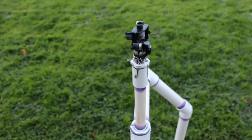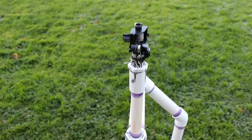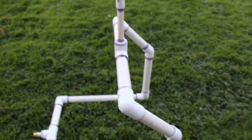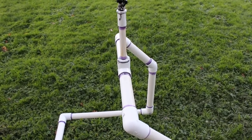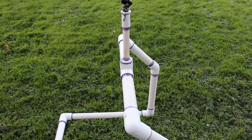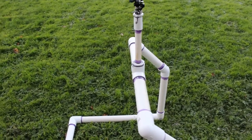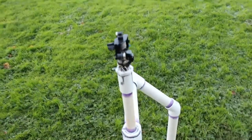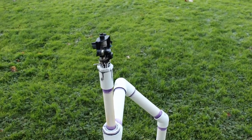Normally when you have it installed at the nursery, it will be on a long riser, and the riser is this same 3/4 inch pipe, but it runs straight to the ground, and it's installed into a supply pipe that's a large diameter, like the 1.5 inch you see there, but buried in the ground by about 6 to 12 inches, usually more like 12 inches, because what will happen is, as this thing starts to kick back a little bit, it sort of sways the riser back by 6 inches or flexes it back.